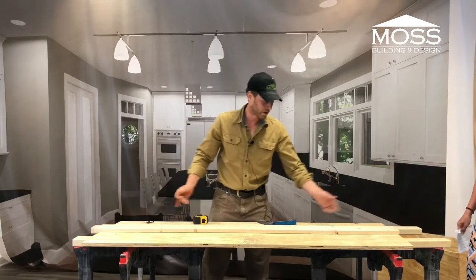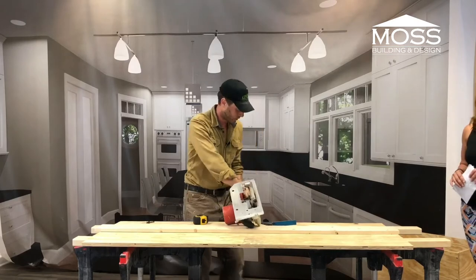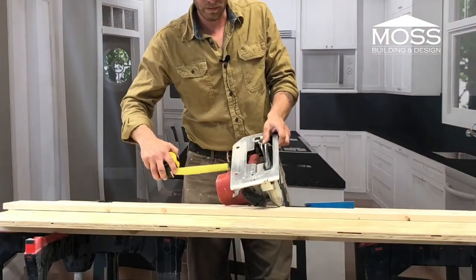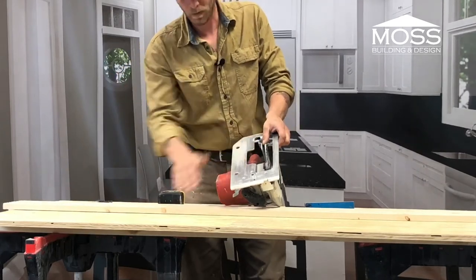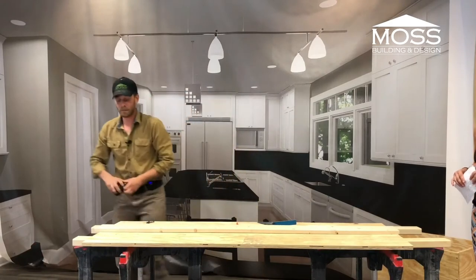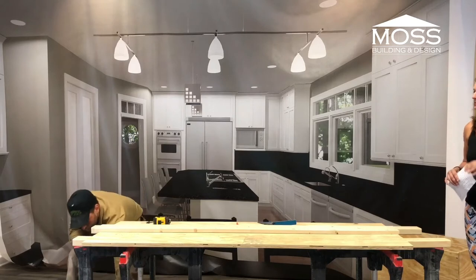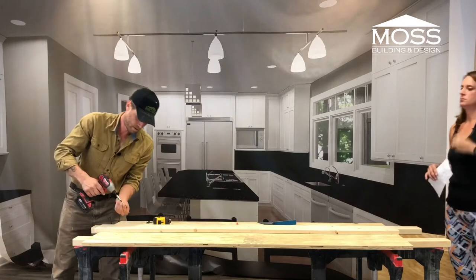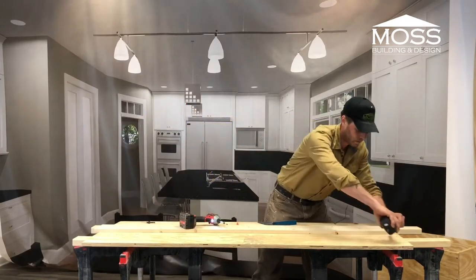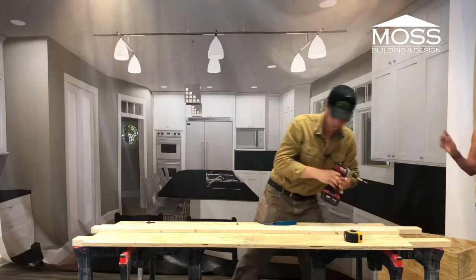If we really need this line to be nice and sharp without using a table saw, we're going to set up what's called a false fence. You can use clamps on either end, or today I'm just going to screw it in because it's just as fast and easy. The important part is I need to measure the depth of my fence — the distance from the inside of the blade to the outside of the fence, because I'm going to let that side of the saw run across this temporary fence. It's five and an eighth of an inch.